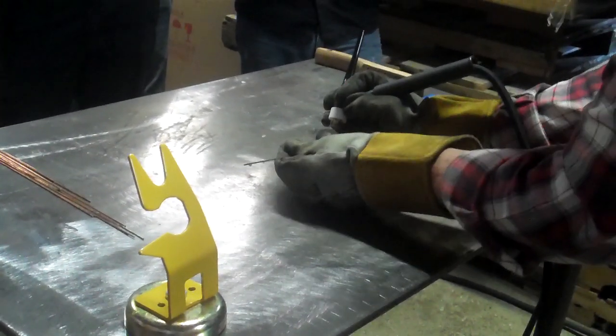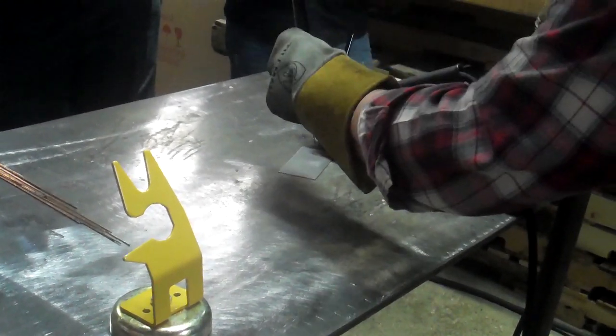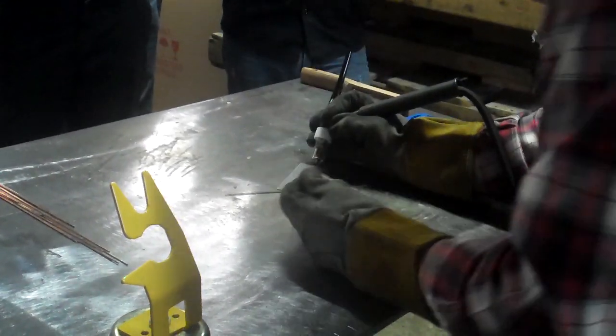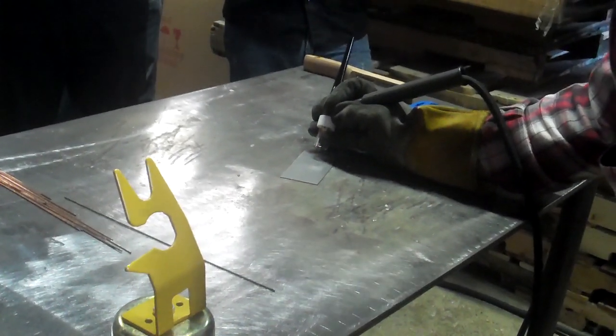You want to put it into the leading edge of the puddle. You don't want to come over the top with the welding rod because there's a good possibility you're going to touch the tungsten, and then that's going to slow you down. So initially we're going to start by not even using welding rod, and we're going to strike an arc. Now you can all put your helmets down.